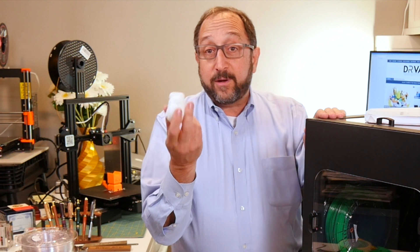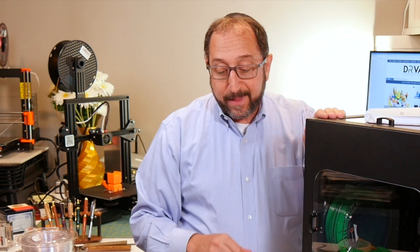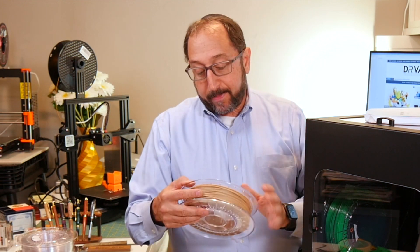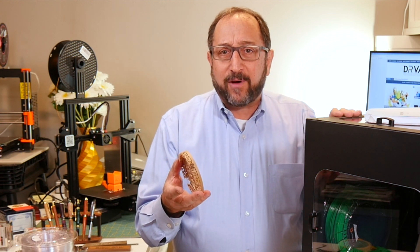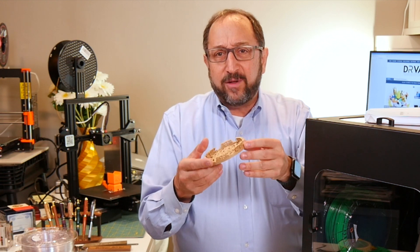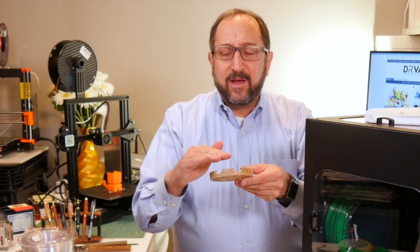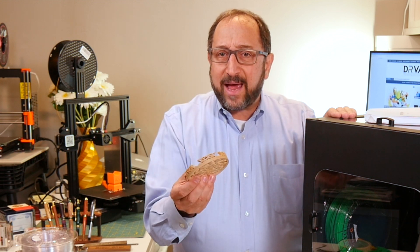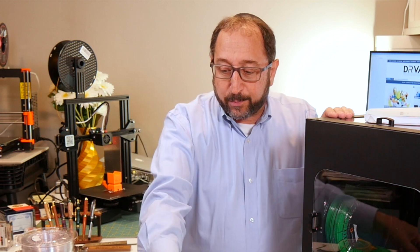So now I've printed in high-temperature plastic and with the filament they supplied. This calibration text was printed in Hatchbox PLA. And so I decided to test something a little harder, but I really didn't do it right. I loaded some ColorFab wood fill into this printer and I didn't tune a profile at all — I just selected the PLA profile because the temperature is about the same. This print I would say failed. It looks very nice except that some of these features are clearly failing where the filament did not adhere properly. I saw the same effect where the print head was hitting part of the print, so I have to do some Z-hop tuning and slow it down — it was at 60 millimeters per second. But it is clear to me this is possible on this printer; this particular print just did not come out.